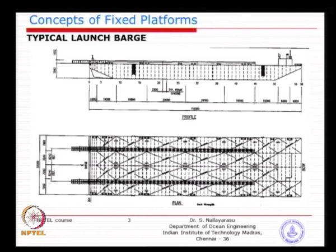The idea behind dividing the barge into several subdivisions is basically to make sure the barge is stable, even if some compartments become damaged — one may leak or be damaged due to issues during transport or corrosion. That is why you divide the barge into various sub-compartments. With about forty compartments, damage to one means only a one-in-forty probability of failure, whereas a single pontoon with any damage will fail the whole barge.